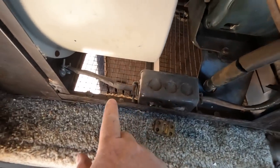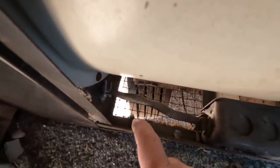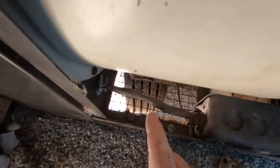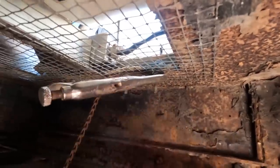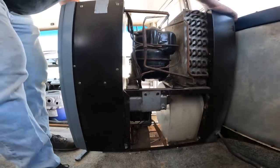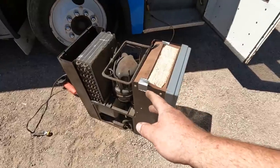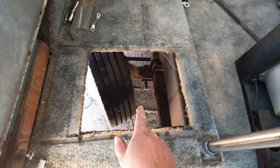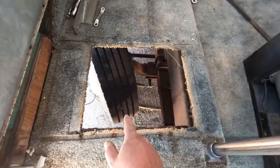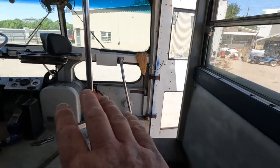Here's a better view of that trap door — you can see there's the front tire, and here's the little pull chain that closes that door. Those are the bolt heads I need to get to. There's a bunch of screen, so I won't be able to reach them from the bottom unless I remove the screen. Vice grips on one side, a drill on the other. Some of these bolts are not as cooperative. This is not a light unit — it's out. Gravity helped. Taking the air conditioner out freed up a lot of space, and the view from the seat is way better. You can actually see out that windshield.